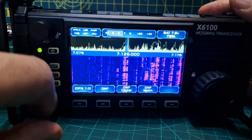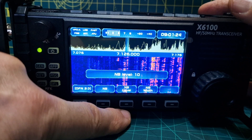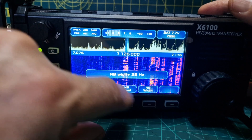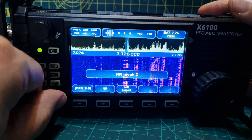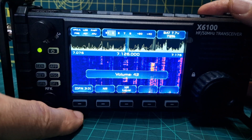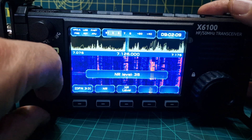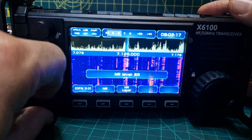On. Not a massive difference there. Let's push it again — we go to menu 2 of 3: noise blanker level, noise blanker width, and obviously turning it on. Let's push it again and now we go to noise reduction. Noise reduction level goes up to 60. Let's turn it off, lower the volume. On — I think it does make a difference. On at level 0. It does work.